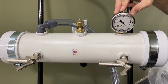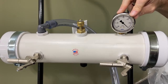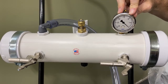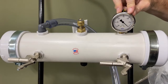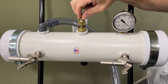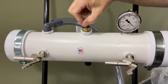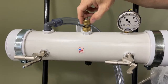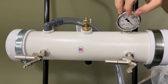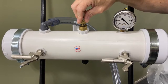When you turn the vacuum pump on, it's preset at 14 inches of vacuum, so the gauge will come up to 14 inches. If that needs to be changed — for example, if you're milking goats and want to change it down to 12 or even 11 — that's done here. You simply loosen this silver nut and then you're able to turn this brass collar by hand. Tightening it will raise the pressure and loosening it will lower the pressure on the gauge.